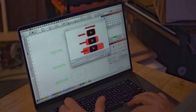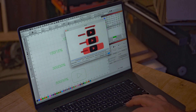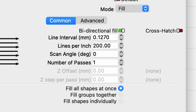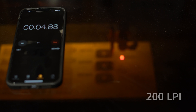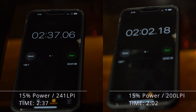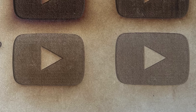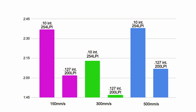So this is where I was wrong. Before I started the test, I assumed that though it had a greater distance to travel, the extra speed would compensate. Don't worry though, there's a workaround. If you increase your interval setting to 200 lines per inch, you'll be forcing your laser to travel fewer times for each inch of engraving. I re-ran the test at 200 lines per inch instead of 254 lines per inch. Our 150mm speed test ran 35 seconds faster, the 300 test ran 26 seconds faster, and our final test at 500 ran 31 seconds faster than the test at the lower interval setting.